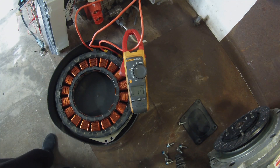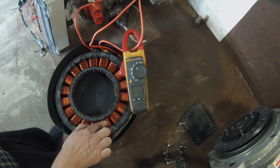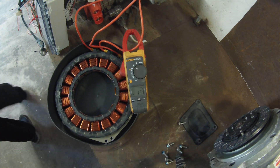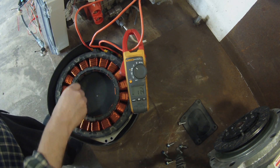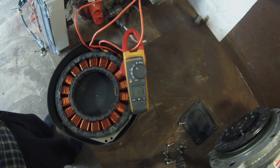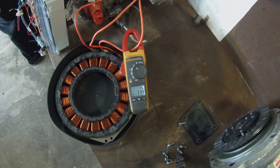Okay, that's giving us something to think about — 11 amps. We're basically pushing 50Hz AC in here, three-phase into our windings, and this is working as an inductor to simulate a motor. In there we should have some magnetic field. Oh yeah, there we go — a little bit of magnetism going on. Let's run some more current through this thing — let's go for 35 percent.